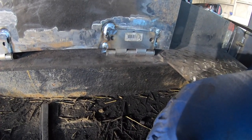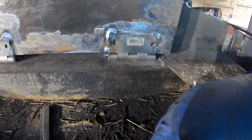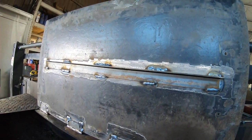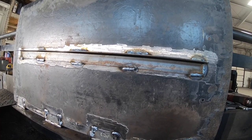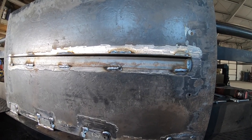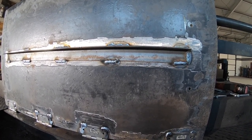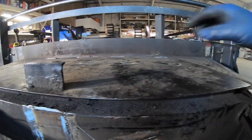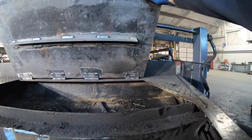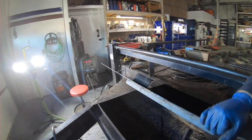Having all the same knuckle pieces on the door helps maintain a consistent swing — I've had them bind up before and it's been a real problem. The door was warped badly with a spring to it, so I worked it back and it's actually got a little crown to it now, which is good. I welded a piece of angle iron in here as a support to keep it straight, so it won't be holding water anymore with the lid closed — now the crown should shed water. I've got some weather stripping to put on the lid so when the door comes down it'll sit on the stripping and keep it more watertight.